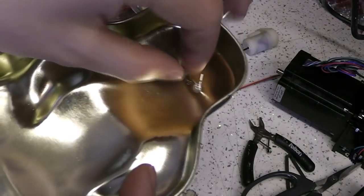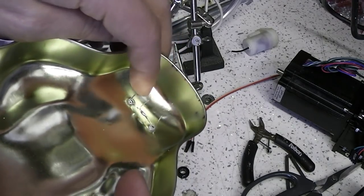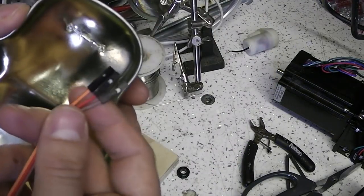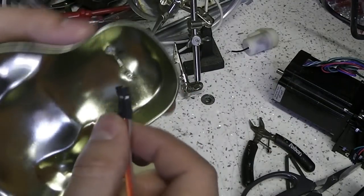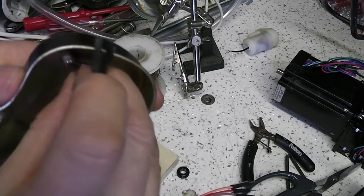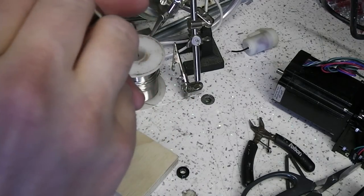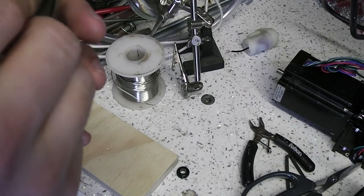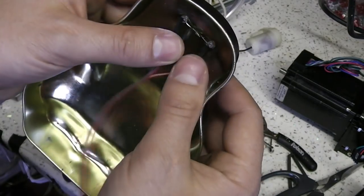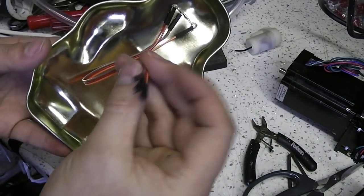So I just soldered the two negative pins of the LEDs together and cut down the positive leads, and that one negative pin I left sticking up, because this is what I really like, these jumper cables. I bought a ton of these off eBay now. What you can do is plug that one in there, so that grey one is going to be negative, and plug one of these onto each of the positives here. So that's made a pretty good connection with all those LEDs. Then all I need to do is bend that whole lot down, and that end can plug into the breadboard.